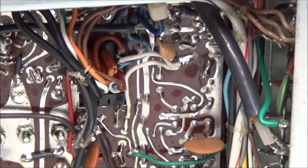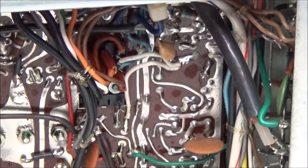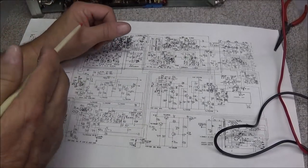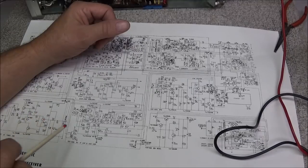And another thing to confirm it is that these two radios, although they're built just about alike, have many differences in the circuit boards. None of the circuit boards, especially the oscillator board, is alike in the two radios. Neither one of them matches the schematic that we have. So that makes troubleshooting a lot harder now. I took the time in the other videos to trace through stuff, trying to get the receiver going, making little notes here and there, and drawing out some schematics by hand to figure out just what was going on.